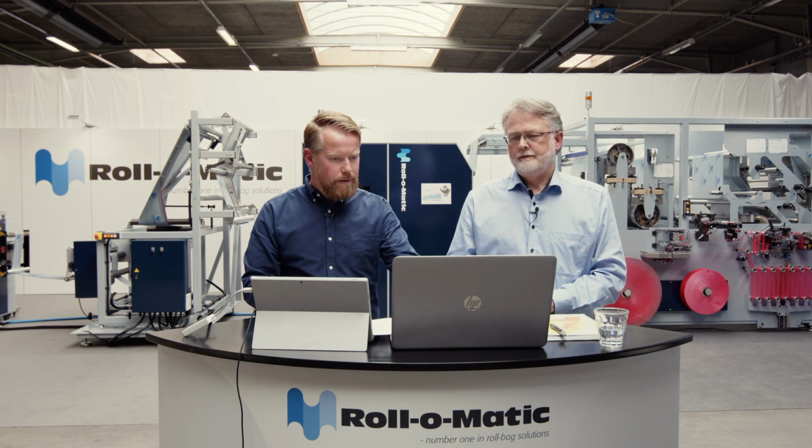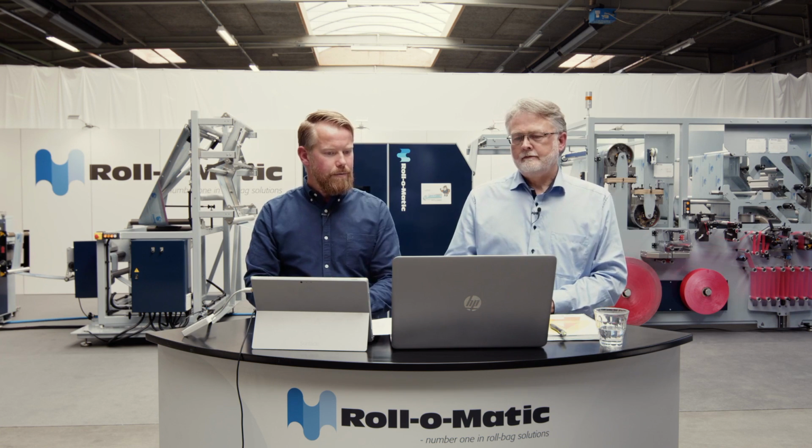So, then a question on whether we can run with print mark registration and how does it work? Yes, we certainly can run registered print. There's a photo sensing system that goes directly into the PLC and controls all the servos. So we can keep the print very accurately positioned on the bag, and at the same time keep the perforations, the sealings, etc. in the correct position.